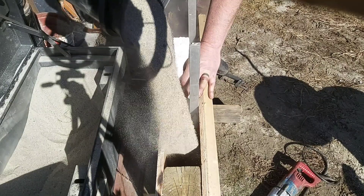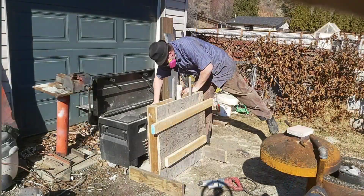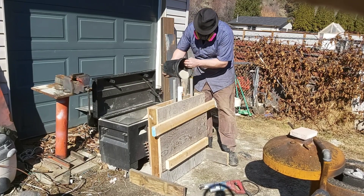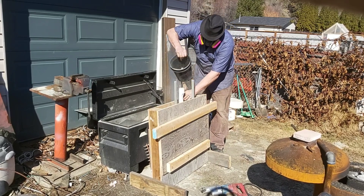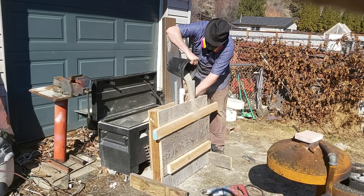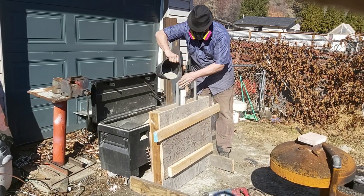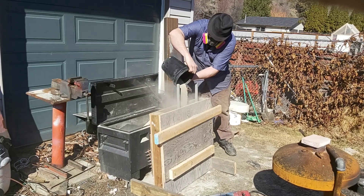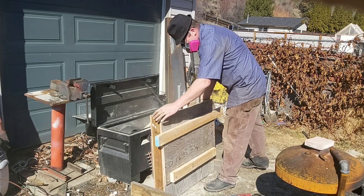In case I didn't say this earlier, the foam was covered with a white substance which is basically a watered-down drywall mixture, and left to set for three or four days to make sure it's thoroughly dry. We want to make sure everything is super dry here because, as we know, water expands 1,800 times its size, and if you pour molten aluminum over water or it even gets near it, there can be explosions and all kinds of sadness — so we're going to make sure today everything is super dry.